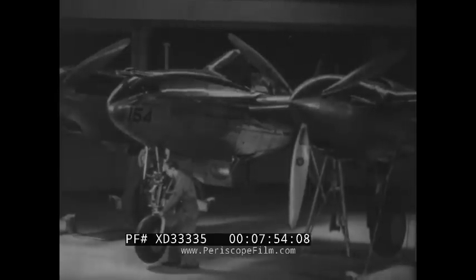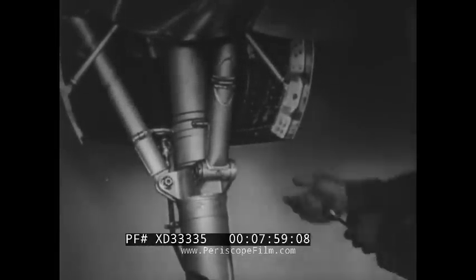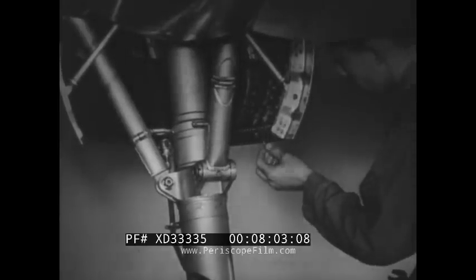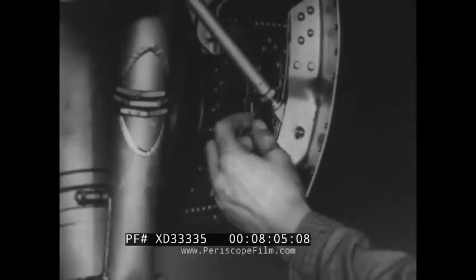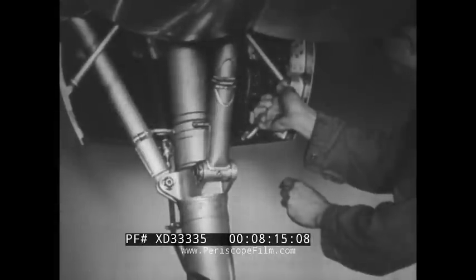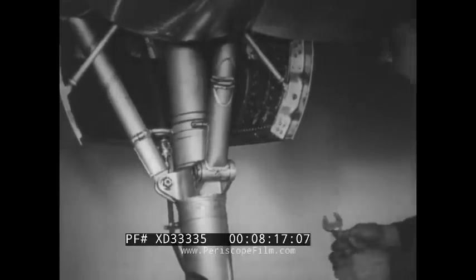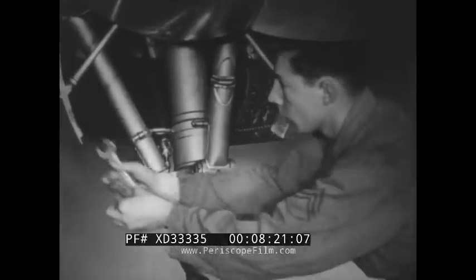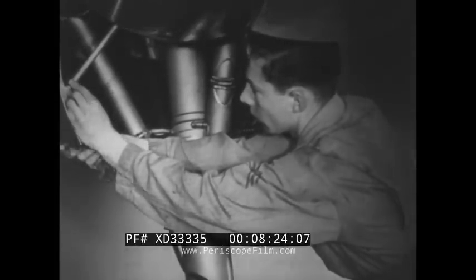For a complete and thorough inspection, the airplane must be wing jacked. With all weight removed from the alighting gear, you will be able to detect loose or ill-fitting parts by shaking the assembly. Test the doors and see that the turnbuckles on the door-operating rods are properly adjusted. If you can thrust the wire through the testing hole, the bolt is not safely threaded and a longer bolt should be used. Test all brackets and braces by shaking them — in this way you can detect worn bolts or enlarged bolt holes which have been worn out of round.